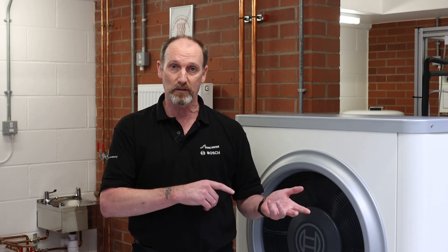One of the benefits of the Worcester Bosch hybrid heat pump is it has the ability to go onto anybody's combination gas boiler or even a combination oil boiler. The beauty is we can use a 240 volt switch live, or we can use a low voltage volt-free contact if you want to. We've also got a system variant — if the house is bigger than a combination boiler can cope with, you go with a system boiler, a Worcester boiler with a built-in diverter valve cylinder, and then the hydro box that sits inside bolted onto the outdoor unit.